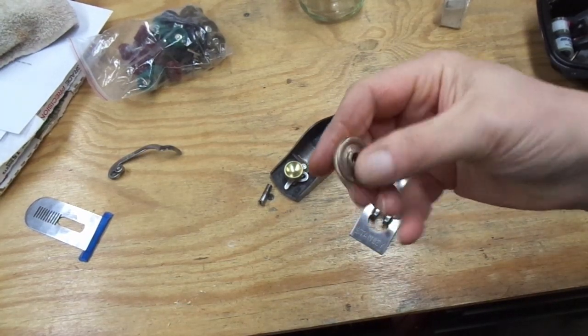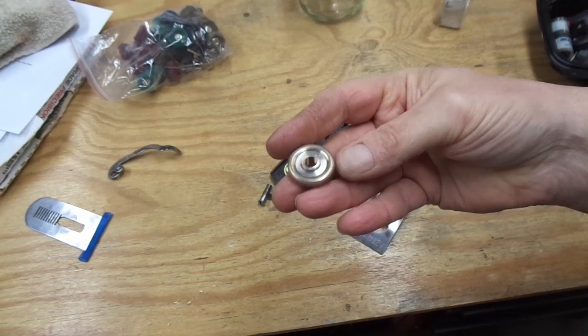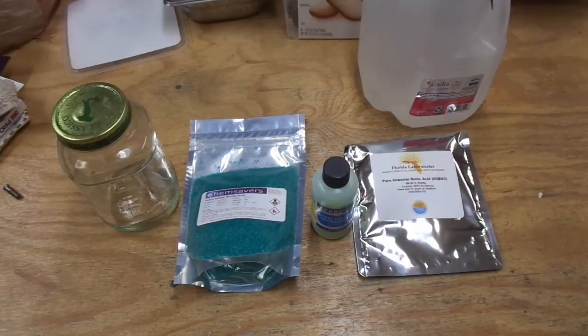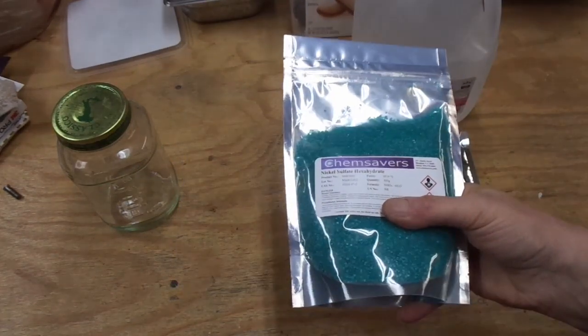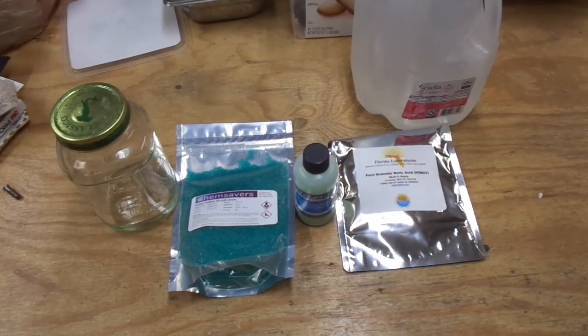The depth adjuster wheel still has copper on it, so I'm pretty sure I'm going to simply do a nickel plate on this and call it a day. The Watts bath is essentially distilled water, nickel sulfate, nickel chloride, and boric acid. I'm following the procedure from the YouTube channel Garage Science, and I'd like to extend my thanks to that guy for putting together a great video on how to do this. I'd recommend checking out his channel — he goes into a lot more detail than I do.